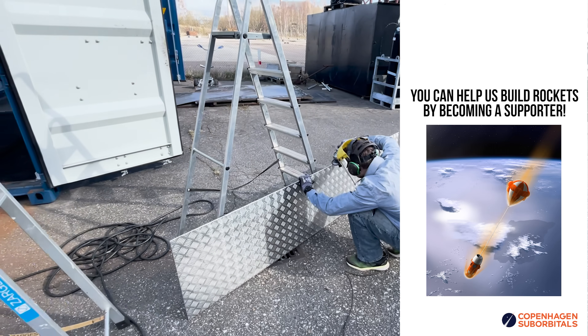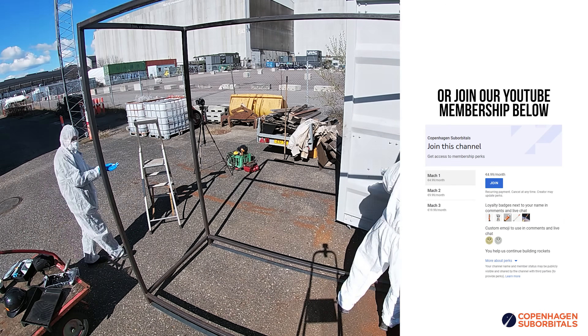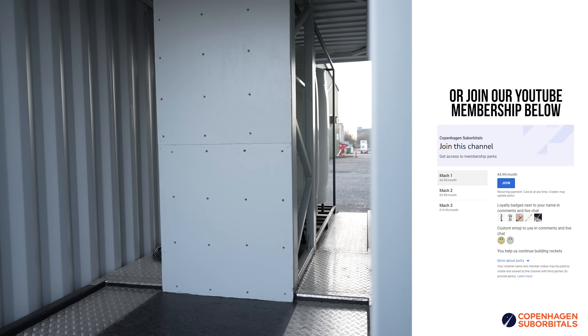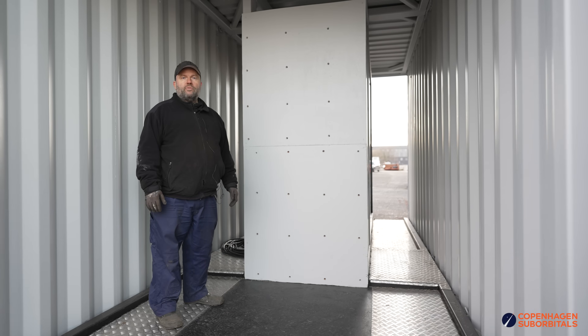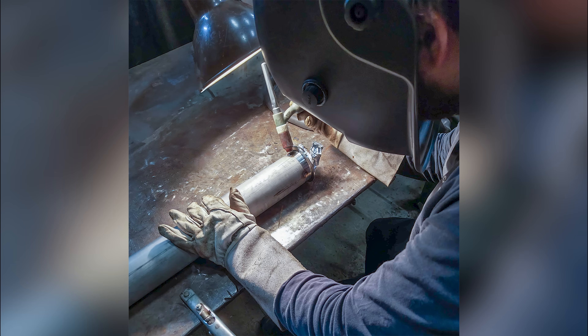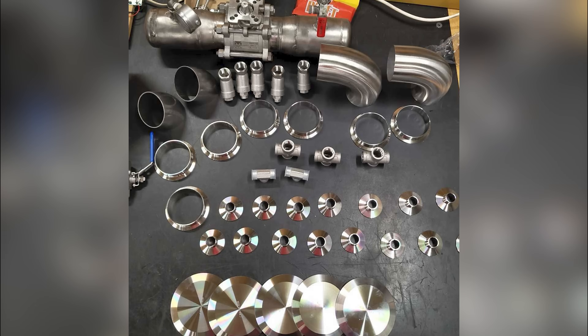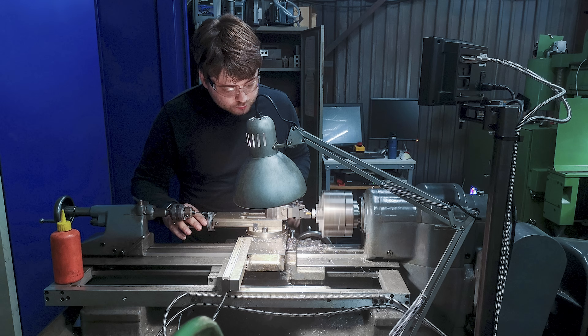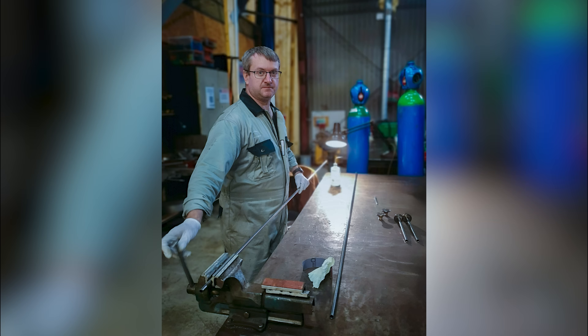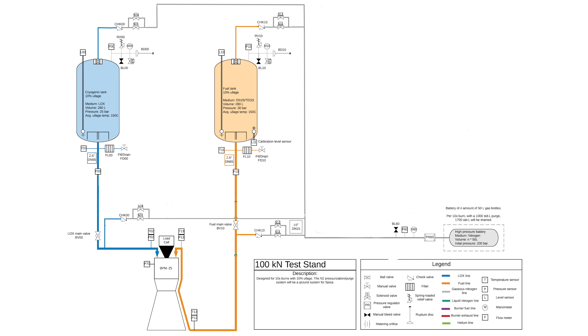The test stand is pretty much done — floor paneling is in, paint is everywhere, no sign of welding left uncovered, so this one is good to go. Now that it's ready for fluids integration, we've already started welding pipes, installing pressure sensors, vent valves, and burst discs, ordering other parts like main valves and all kinds of fittings, and even making our own capacitive fluid level sensors for the propellant tanks. Later we plan to give you an update on the entire fluid system and how we plan to pressurize the whole thing for our first BPM 25 rocket engine static fire.